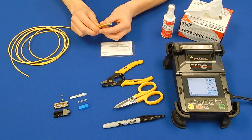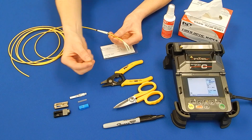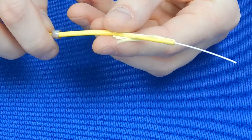Next, slide the metal crimp ring over the field fiber, followed by the plastic ring. The plastic ring stays over the Kevlar to keep it fanned back. For ST and LC connectors, the smaller crimp ring will work.